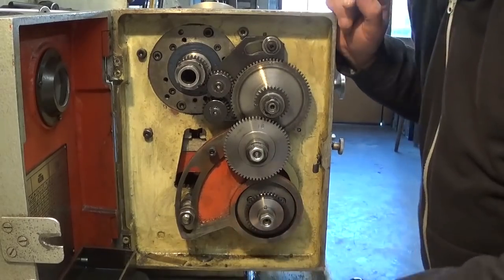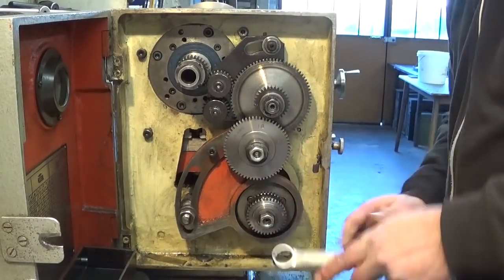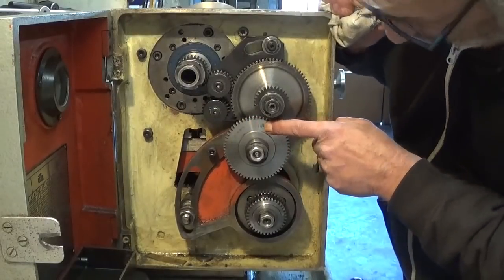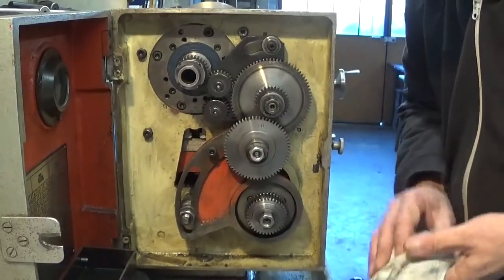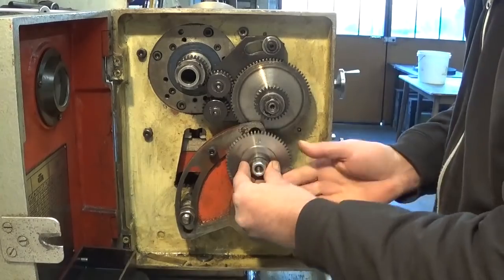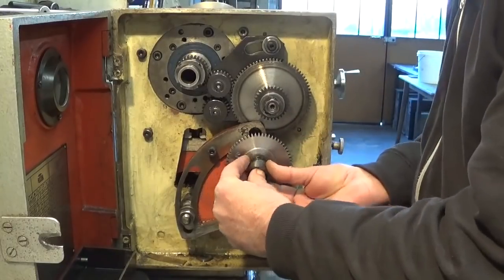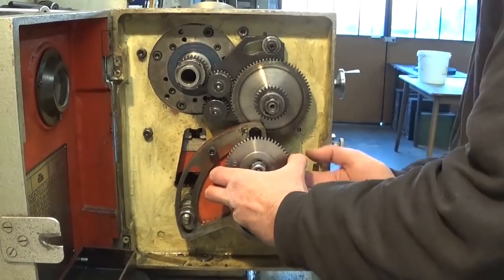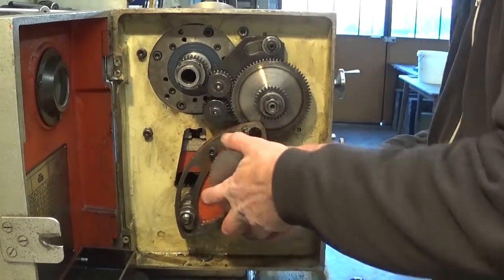Look at this. And I put this gear as a spacer. And then of course we immediately see that there's another problem. This 60 gear, and this 60 is marked here, is too small to connect these two. So even if I move the banjo, it will not do the trick. So I have to take it out. Come on, gear, get out. And hope that the 72 will do the trick. 72.